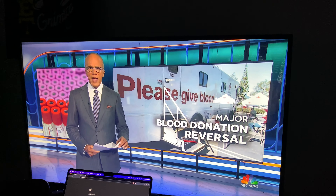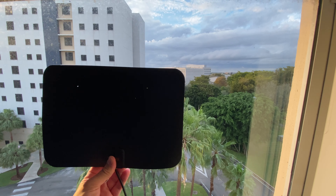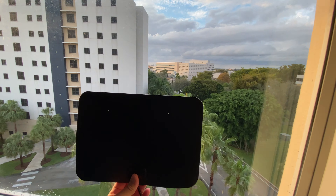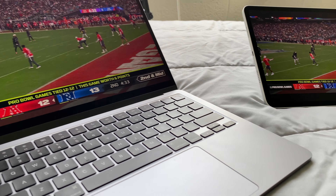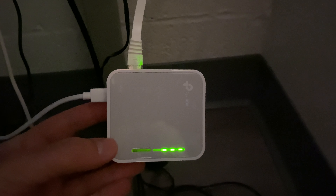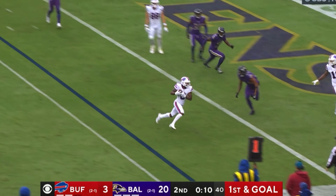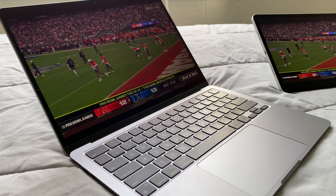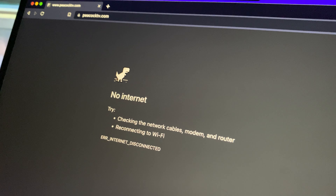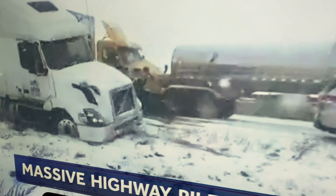These signals are picked up with a TV antenna and sent to a TV. If you want to watch antenna TV on a mobile device like an iPad or an iPhone, plugging your antenna into a box called an HD Home Run and connecting it to a wireless Wi-Fi router allows you to watch live TV on any of those devices on your network. This can all be done without ever needing internet. Stick around to the end of this video to see how to get that working.